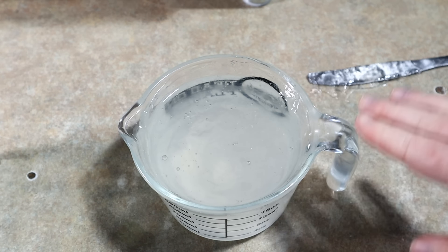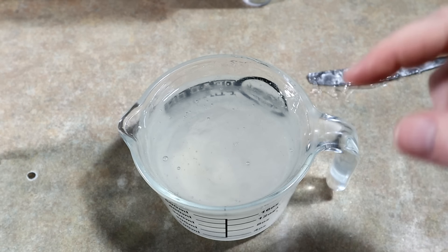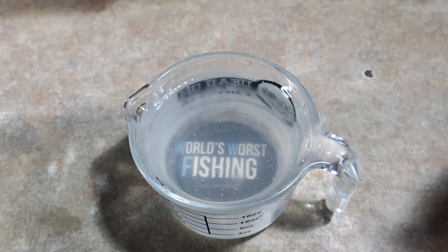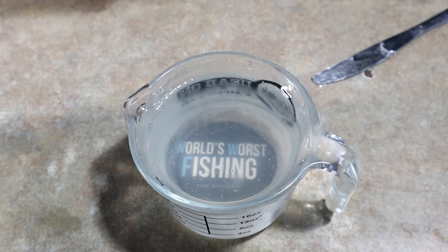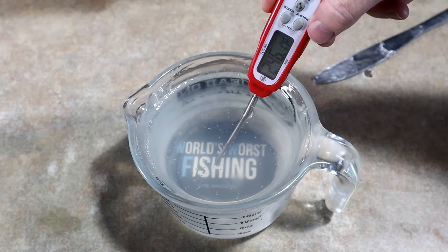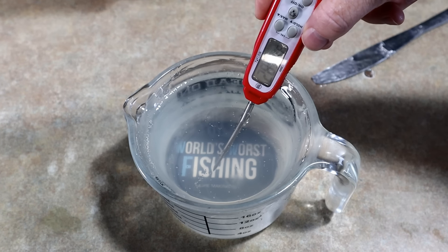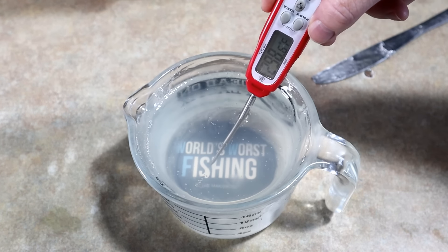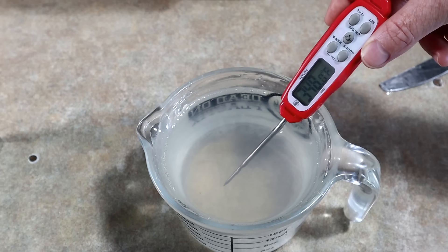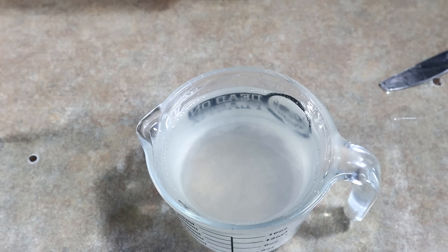For compare and contrast, the same amount of black label plastic in this cup would be a little further along in the cook cycle, so this one's going to take just a little bit more in the microwave. Just to give some perspective on how see-through this stuff is — you can pretty much read the sticker on the bottom. We need to reach 350 degrees Fahrenheit to really get it all the way. We are officially there — internal temperature has reached or exceeded 350. Crystal clear, no bubbles.